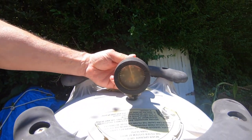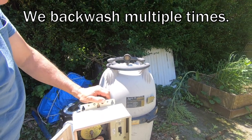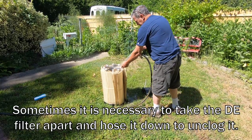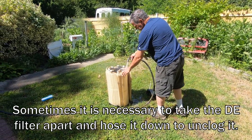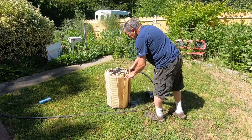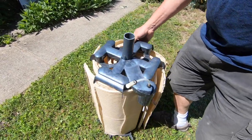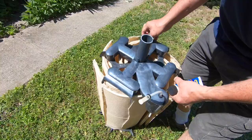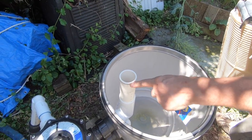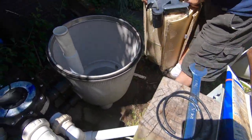The pressure is too high, we need to backwash again. The Polaris is off so it's definitely not that. He's spraying down the filter — he pulled it out because it got to the point where it was so clogged. We tried to keep it together but accidentally it came apart, so we'll have to jigsaw that back together — we've done it before. We got it all cleaned and put back together. There's an O-ring that goes here around the down pipe — it broke, so he went to the store to get a new one.